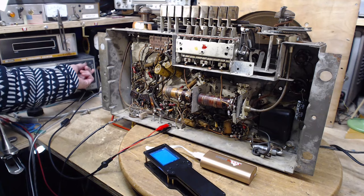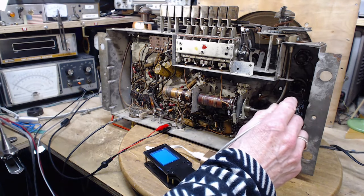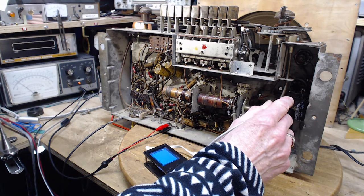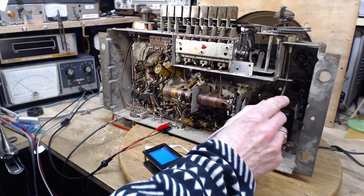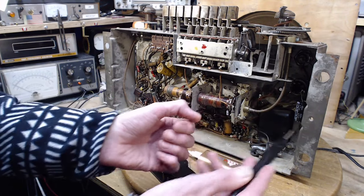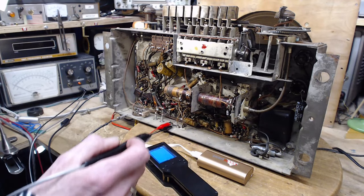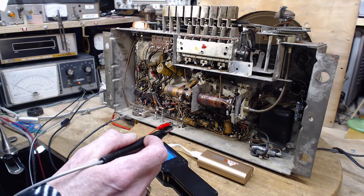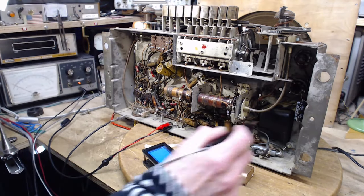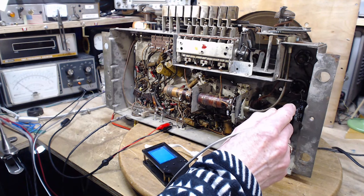Okay, we're on the 500-volt scale here, positive upscale. What do we got on here so far? We got a little bit coming up already. Where'd it go? The meter went up and then right down. Careful. This has got a wire hook here, so you can hook it on stuff, and sometimes it hooks and you don't expect it. So radio's not making any sound yet. 83 volts on it. Interesting that this went up and then came down.